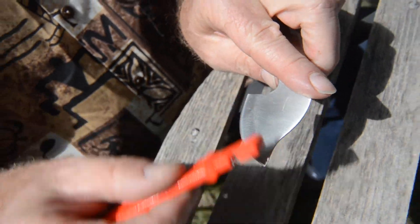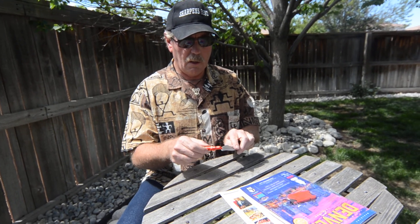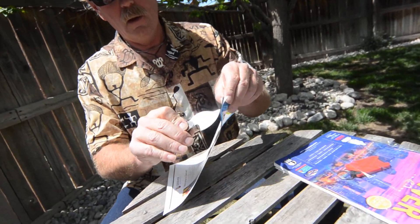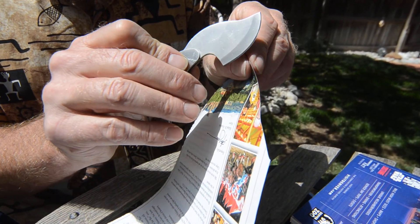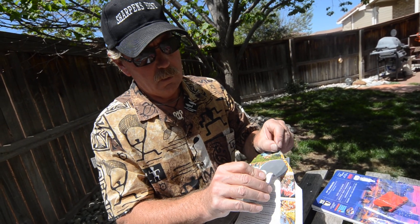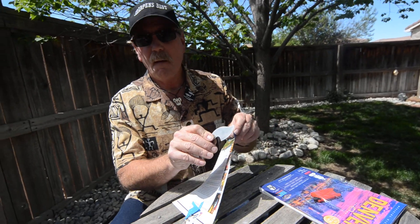Right now I'm going all the way from the back to the tip in one pass, just like this — goes around and right down there off the tip. Just like that. Turn it over and do the same thing. I've been working right on the cutting edge, probably no more than about a minute and a half to two minutes of actual work time. Let's see if we have a better result. Oh yeah — much smoother, much easier, quieter, more defined on the cut, less tearing, just plain and simply better.